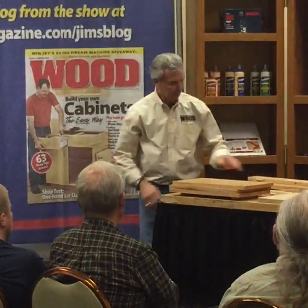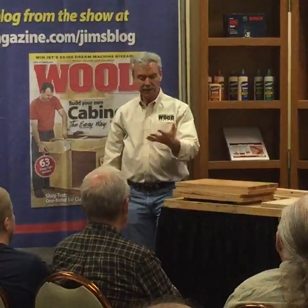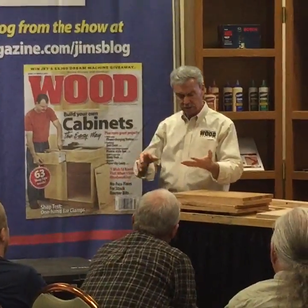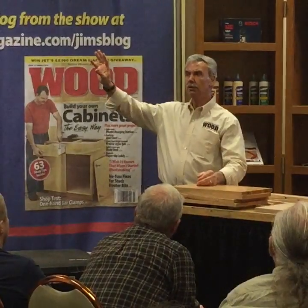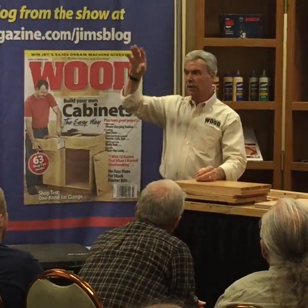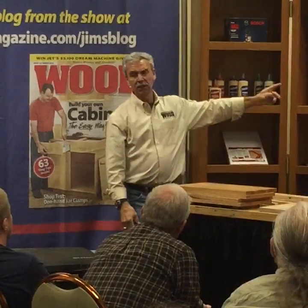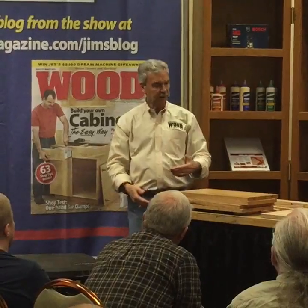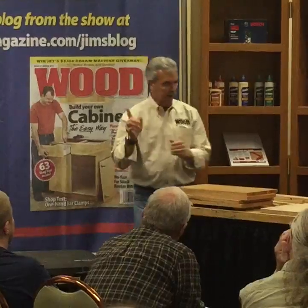These are my boards. There are 4 of them here. They're all dead flat. If you know anything about the shows, we have a horrific schedule. Everything goes back in this black crate. We did one stretch where we went from Columbus to New Jersey to Houston to Minneapolis, where the humidity was everywhere. These boards are taking and giving off moisture. They should have exploded because I didn't worry about which way the grain went. They're flat. So when you narrow those boards, it really does help some.